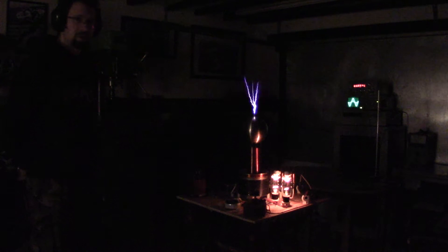It's running about 6 amps currently, and it's pretty quiet. Most of what you can hear is at 50Hz, but it's a nice 50Hz. And you can see the waveform over on the oscilloscope over there — that's showing about the 360kHz frequency. The frequency counter is saying about 145, and we know that's lying. I've already proven that's lying, but it's interesting to see it running anyway.